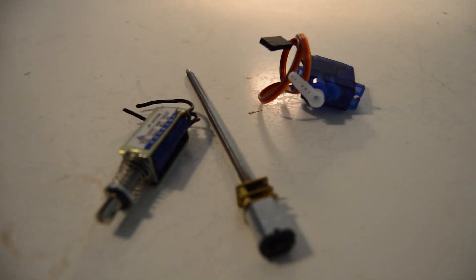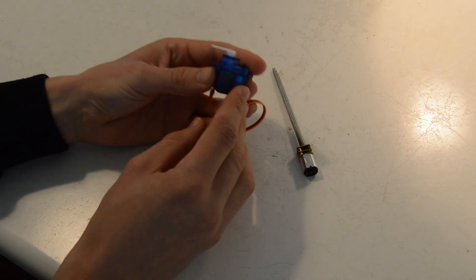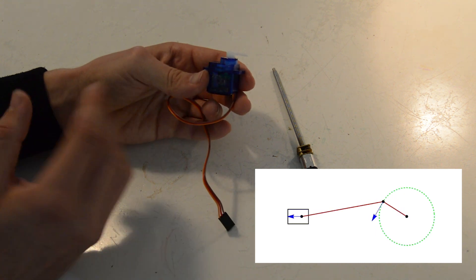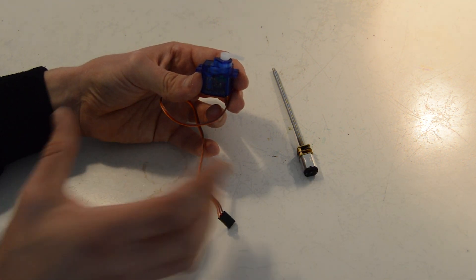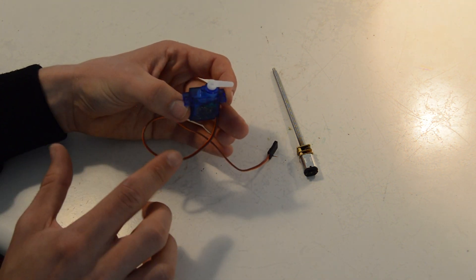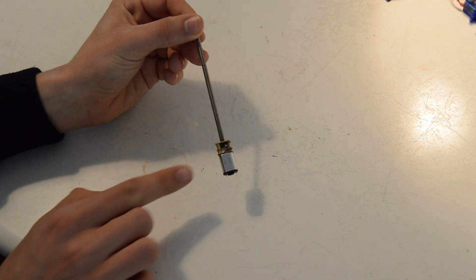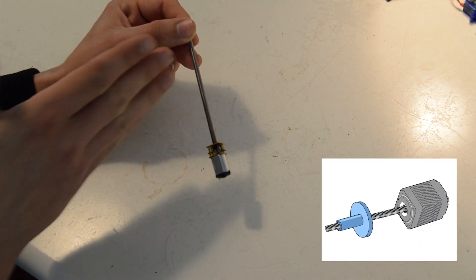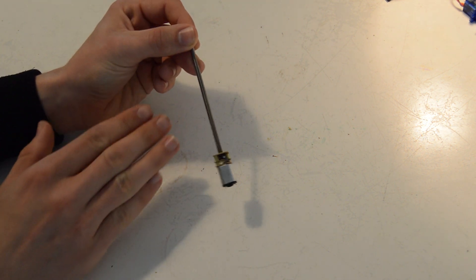When it came to choosing the right kind of actuator, I had several potential options. First I thought of using one of these micro servos with a piston mechanism — cheap and with fine motion resolution, but difficult to construct symmetrically, so it was scrapped. Then I thought about using one of these geared linear actuator motors, which also allows for fine controlled motion, but it proved to move too slowly and be too weak, so that had to be scrapped as well. Then it hit me.